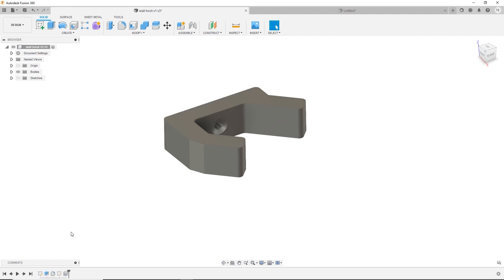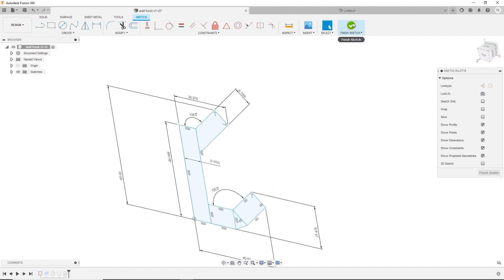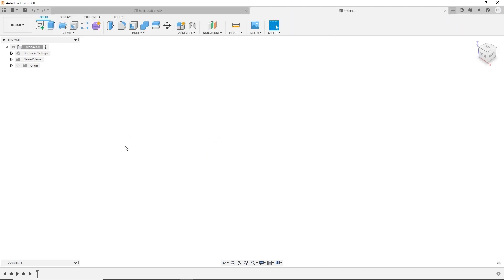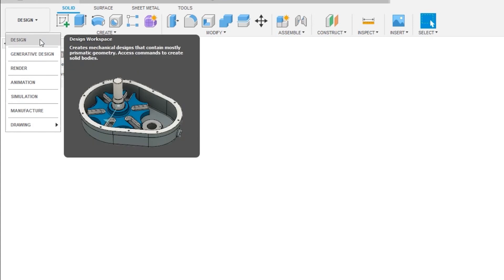When we look at the part we want to make, the first thing we want to do is sketch something like this. It's a little intimidating with all the dimensions, but we can simplify it. We want to sketch this rough shape in one sketch, give it depth, and we're kind of finished. To get started, hit the little plus sign up in Fusion to start a new file. You should see the design workspace toolbar. If you're in the free or hobbyist mode, don't worry about any upgrade buttons — everything we're covering today works in both the free and paid versions.